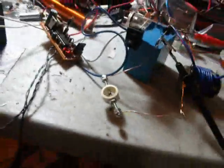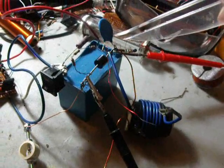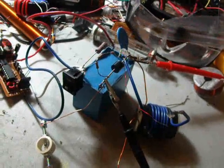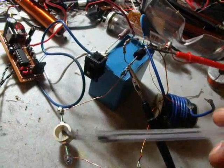I'm going to turn on my charger. I got 765 volts on the main capacitor. The little capacitor is charged to the same voltage actually, but the energy it contains is very small — just enough to temporarily increase the voltage and make a spark to ionize the air between those electrodes.